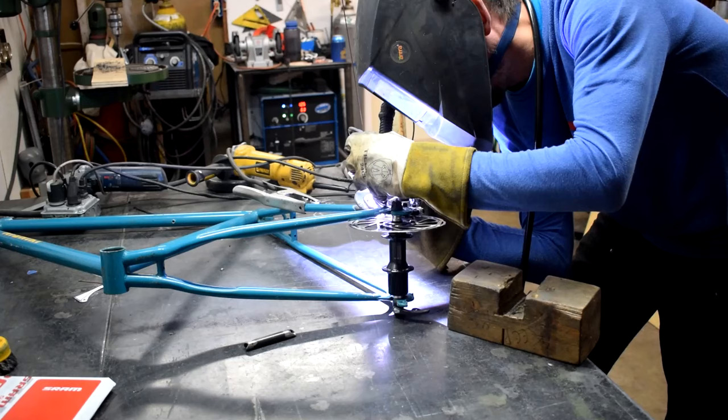The next thing I'm going to do is drop in a little bit of a disc brake support here. This is just a simple piece of tubing — I've already cut it and coped it so it's going to fit into the frame nicely. I've got a couple of fabrication magnets in the shop; they're really handy for holding small pieces like this in place. Grounding clamp on here, do a couple more tack welds. I'm actually tacking towards the rear of the piece of tubing — this is going to help it pinch itself into the back of the frame. Every time you weld, the metal is going to want to move in the direction of the weld, and if I weld it on the front it might pull it away from the frame.